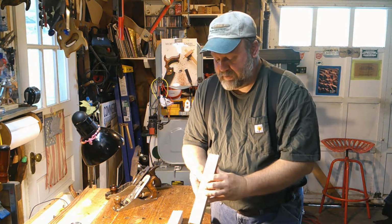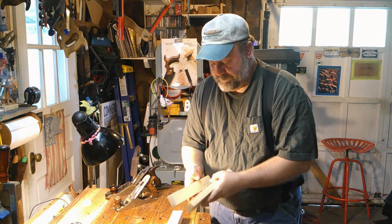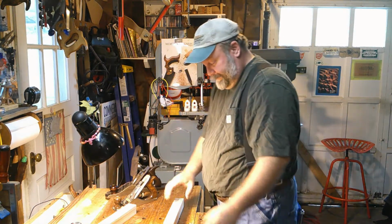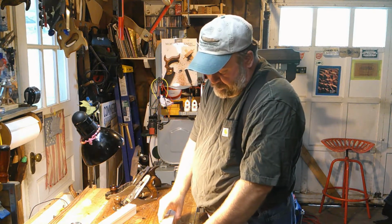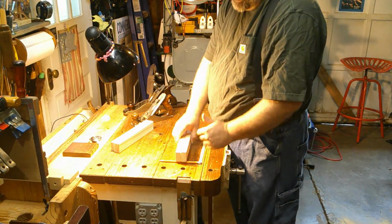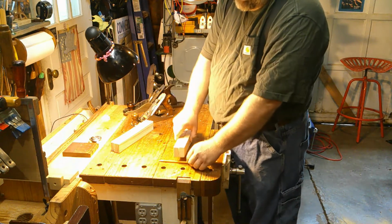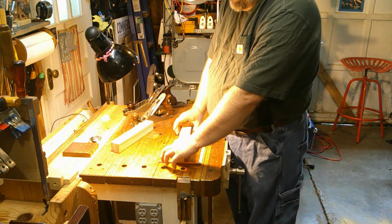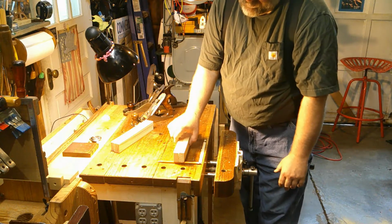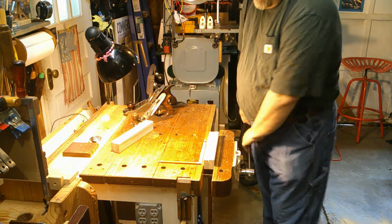We flip those around, try to until it's somewhat satisfactory. Alright. To make sure that the 2 points are within line down here, I usually put a pencil on one end, because if this is humped in any way, you try to line up those 2, they'll be off. But you have this point and this point. If you put a pencil there and set it like that, that plane that's on the bottom should be lined up pretty good. Grab this pretty tight. We're going to set it in here. Clamp down on it pretty good.